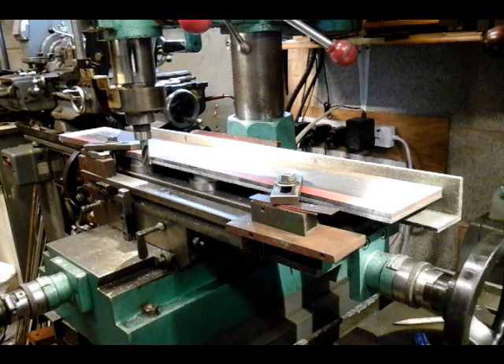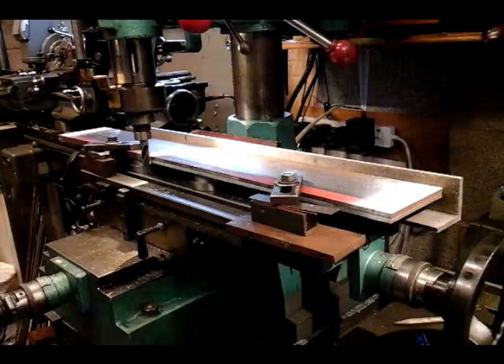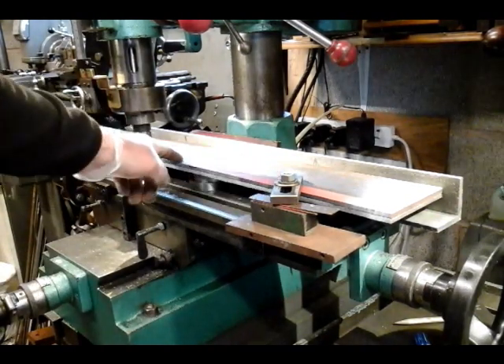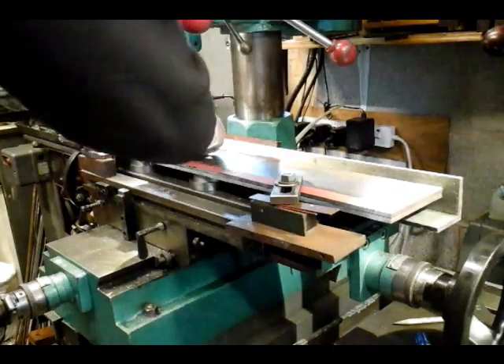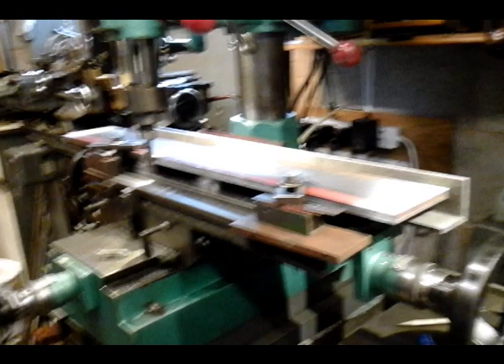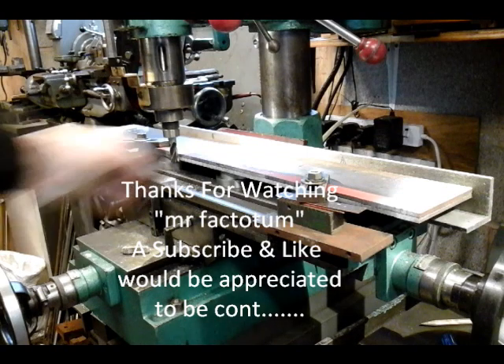I won't bore you with all that machining because it's pretty straightforward from now on. I'll do my main frames for the side frames, then move on to my buffer plates — do the same with them, cut them down and machine them up. When I've got all my material machined square and to size, I'll mark all the holes out and reset it up on my milling machine to cut the slots for my three horn plates to fit. Other than getting it laser cut, this is the long method of doing it but it'll save you a lot of money in the long run.